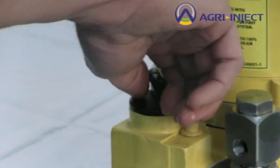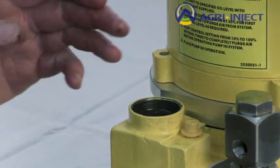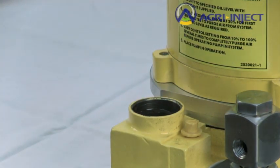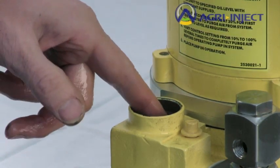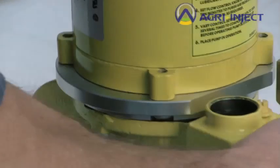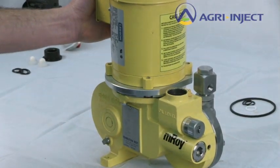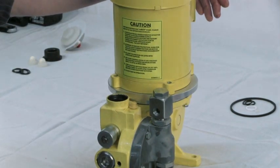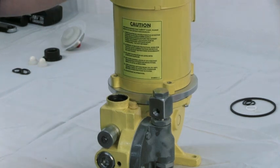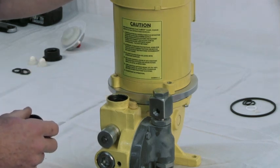We are now ready to refill with oil. There is just an o-ring seal on the oil cap. As mentioned, this will hold 1 quart of oil. Pour it slowly — if you pour too fast, it will run over the sides. There is a very small opening inside the pump that allows the oil to go from the reservoir back into the gears. The oil level is critical to pump operation. If the pump is running without enough oil and you take the oil cap off and hear a suction sound, you need to add more oil.